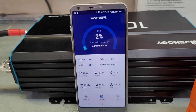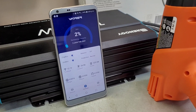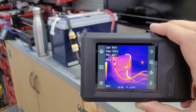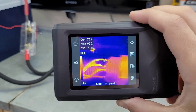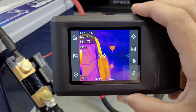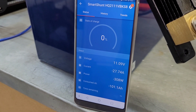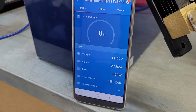We're coming down to the last couple of amp hours on the battery, sitting at 2%. I like to shut the heat gun off when we get this low because if the voltage dips too low the test will stop prematurely — the inverter shuts off at 10.8 volts. So for the last bit we're just going to pull 300 watts. I've got the thermal camera here from HikeMicro — taking a look at temperatures. The positive conductor is a little bit warm, but it's been pulling around 100 amps for the last 15-20 minutes, so that's normal. Battery is coming up on fully discharged — we've pulled 101.2 amp hours, meaning we got our full rated capacity. This would be considered a pass.